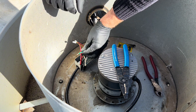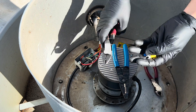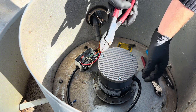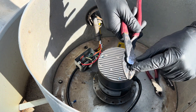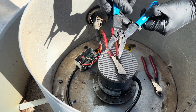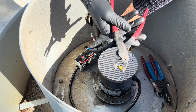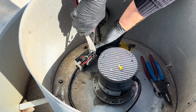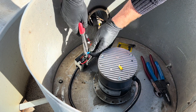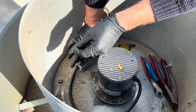I'm just gonna get a little terminal for this and install it — then we should be good to power it up. I always have a bunch of these at the bottom of my tool bag. This one is what I use for crimping — it has a non-insulated and insulated side. I just put it on insulated like this, squeeze, and I always pull to make sure it's all good. Then we've got to get our ground.